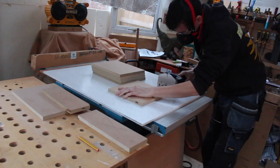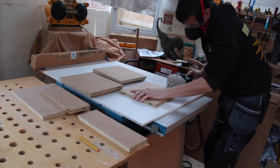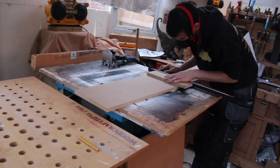I've also marked the thickness of where the shelves are going to go. I always do that because historically, if I just mark one line I might cut above it on one and below it on another, which throws the spacing out.